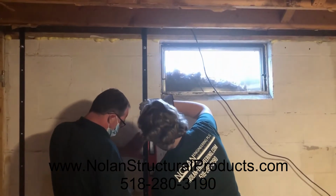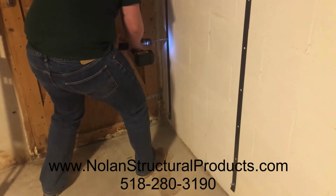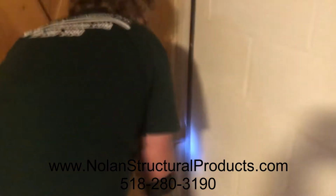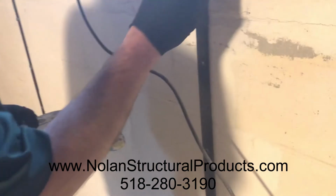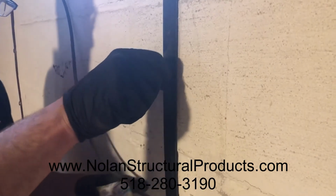Good. Alright. Once you have the strap secured at the top and the bottom, you can switch drill bits to the smaller size one and go ahead and drill all the intermediate holes straight through. Alright, then what we do is we just take the epoxy, roll the bolt in it, and hammer it into the hole.